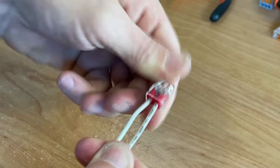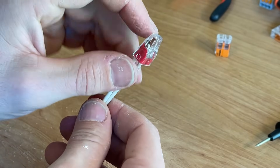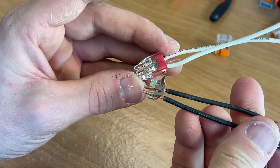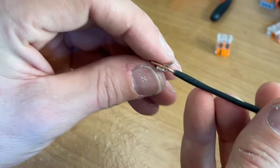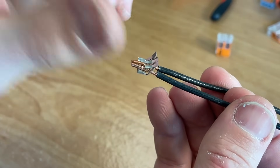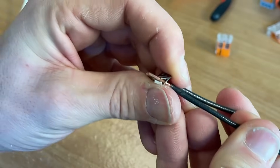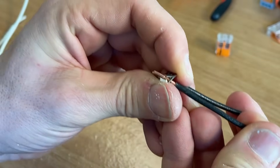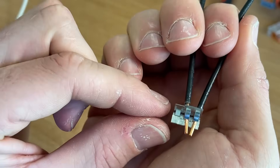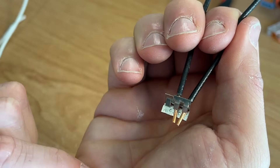It passes the pull test. The big difference is the transparent see-through housing. I actually did remove the internals of one of these to show you how they secure. There are just these tabs that get pressed out of the way when the wire is introduced — that's what's holding it in and biting into the copper during the pull test. This bar that goes across the three different tabs is actually the bus bar, and that's what's responsible for tying all the wires together.